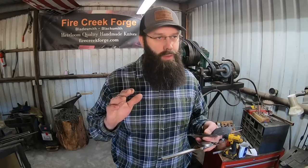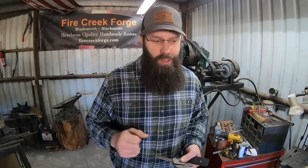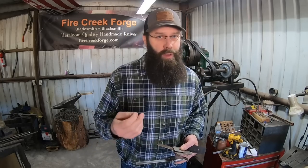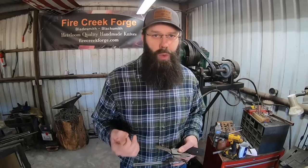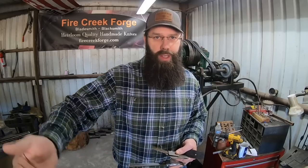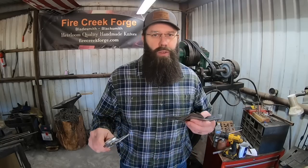Now you can work wonders with that. I have never worked with a blade quite this thin out of the quench and had a little stress point there. Just went a little too far. I've broken blades before doing this that are not quite this thin. And there's a line you have to know where that is. And also the thinner the blade is, it's going to cool off quicker post-quench and move along that steel phase conversion maybe a little bit faster. So there's those variables